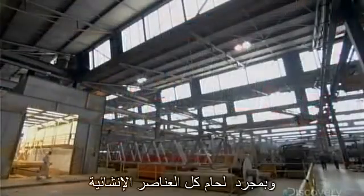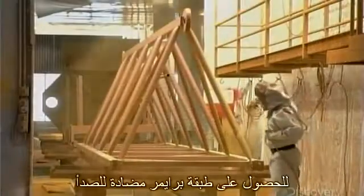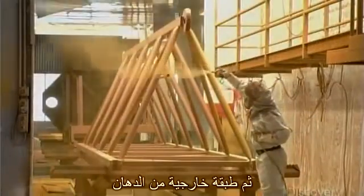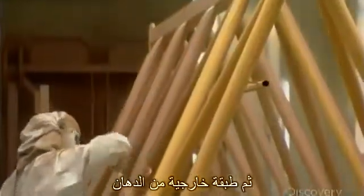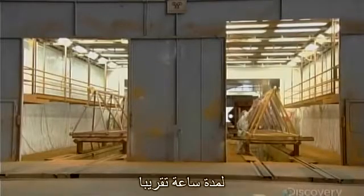Once all the crane's structural components are welded, they go to the paint shop for an anti-corrosion primer, then a top coat of paint. After each application, the part dries in an oven for about an hour at 80 degrees Celsius.